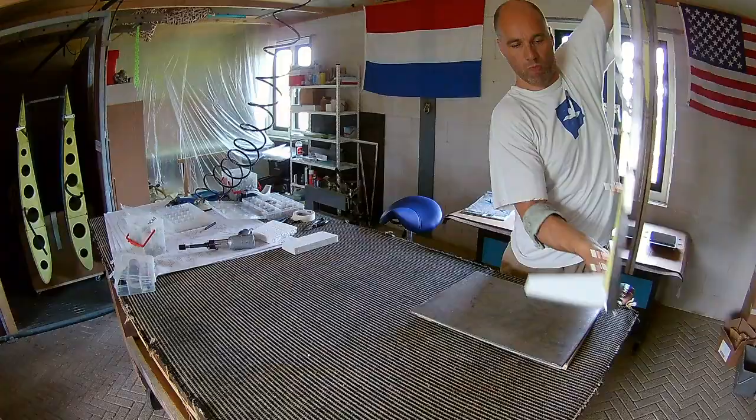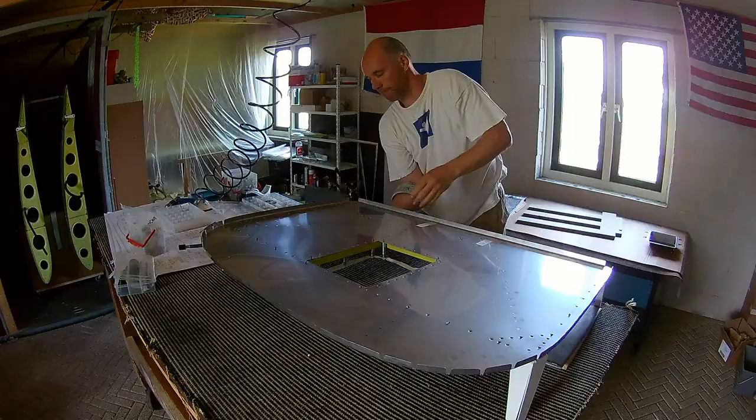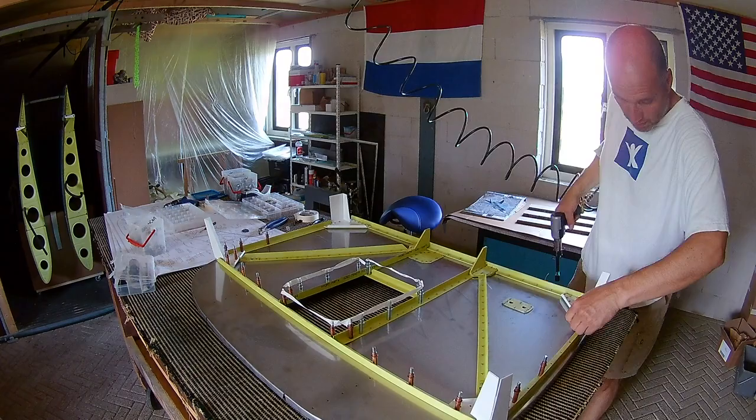All the outside rivets are all size four — a thickness of four. And the inside angled stiffeners and the recess rivets are all threes. So you have to be careful to take the right ones.